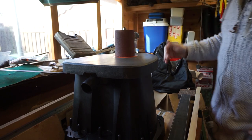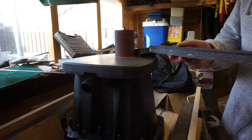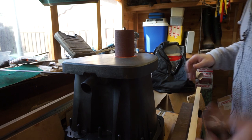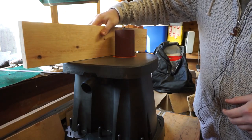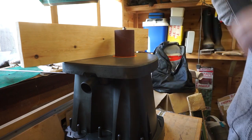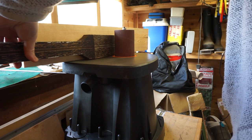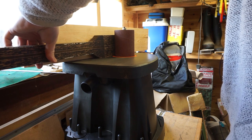So anyway, this thing's obviously normally meant for carving curves on the outside of guitars and things. We're going to be using it to shape the edge of the headstock in the usual manner. But in addition to that, you can use it for thicknessing small bits of wood. All I'm going to be doing is effectively clamping on a makeshift fence at a set thickness, and then I will be feeding in the neck with the back of the neck facing the spindle, and as I push that in, that will thickness that up and I will stop at the volute point.